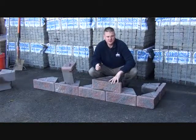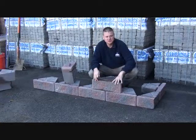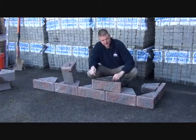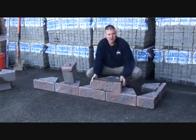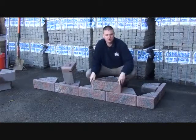One of the benefits of the Cambridge Viking Wall System is that it can be pinned in both a vertical position as well as a setback. To pin it in the vertical position, use your Cambridge pins, insert them into the center holes — they will position down into the channel of the block below — push your block forward and now you have achieved a vertical wall system.